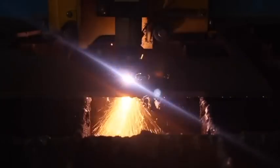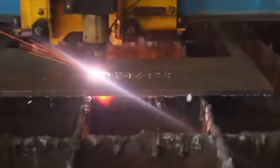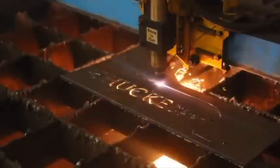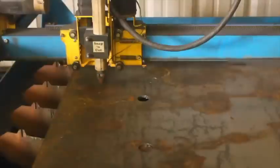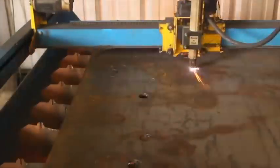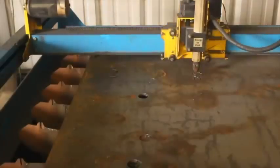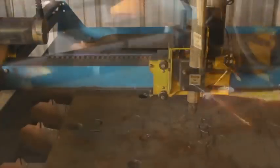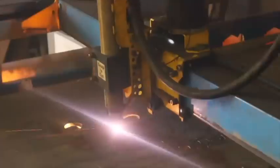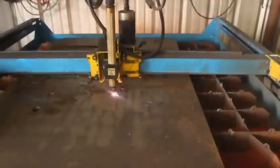And now it is time for us to build what I refer to as the carriage that's going to work with this contraption. Now, the carriage is simply a roller assembly with a hook on the end of it, and it rolls back and forth over the top of the beam. And although you can go out and buy these pre-made, I personally couldn't find one that would fit this size and type of beam. And honestly, I wasn't very impressed with the quality of the store-bought ones I saw anyway, so I figured I'd just go ahead and get some 1/4-inch plate and make my own.